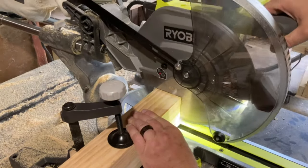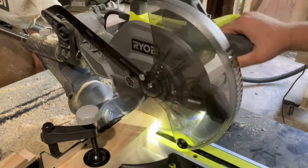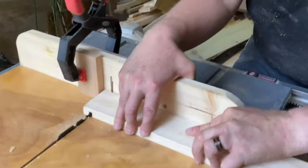The current cabinets in the kitchen are made out of pine, so that's what I'll be using for this project. I'll be using a combination of 1x3s and 1x2s for all the frames of the door and the door casing. To assemble the door casing, I'll be using rabbet joints.